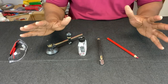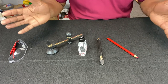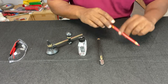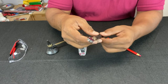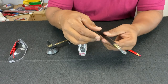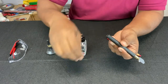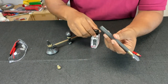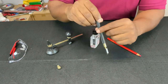So let's talk about some of the basic tools that you can use to cut glass. I have a marker here that you can use to mark where you want to score your line on your glass. This is a pencil grip cutter — they have different types, and this is a heavy duty one. What you do is fill it up with glass cutting oil: you unscrew the end, pour in the oil, and it comes out to lubricate your score. You can also dip it in oil while you cut.